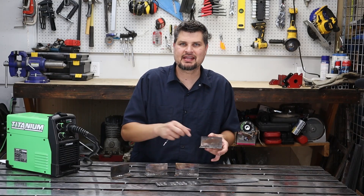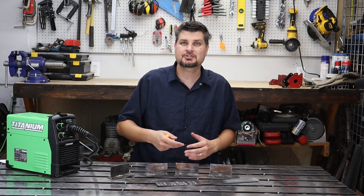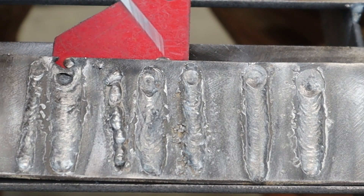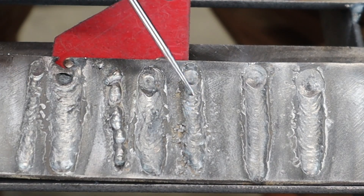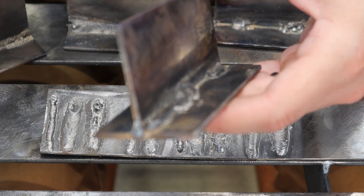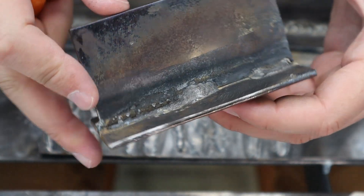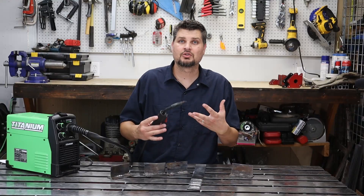Last on the list is stance — but in reality it's angles, posture, movement, and everything that helps with welding. The main thing to think about is your angle. If you're off angle, it doesn't direct your weld where you want it and throws a lot of spatter. On a flat piece, being nearly parallel threw down a lot of spatter. With a fillet weld or T-joint, having your angle off means one piece doesn't get the weld it needs — the weld was all on the bottom piece with nothing going into the top piece, which means weld failure.